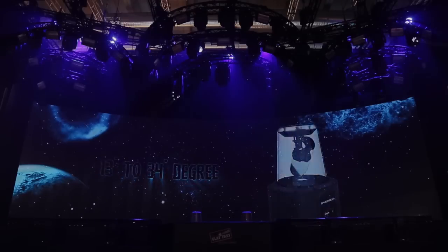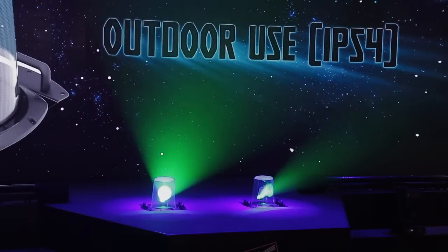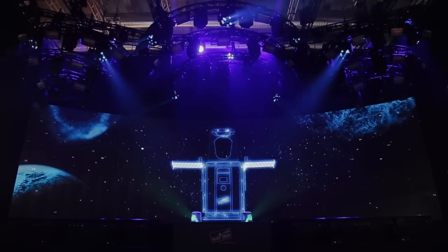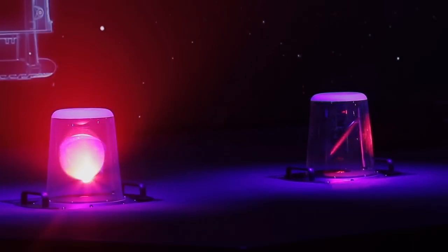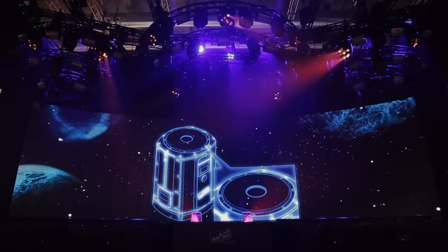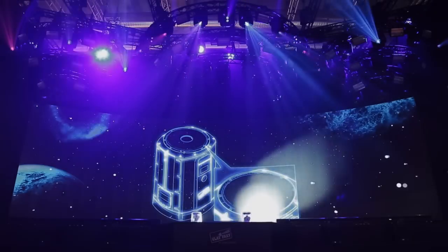Here's another absolutely unique feature — the SpheraScan is also built to be used outdoors. A special housing and the transparent globe which protects its mirror gives it an IP54 protection rating. But that is not all. Just as you can see in this demo, the SpheraScan can be recessed into the stage floor with only its transparent head visible, becoming an innovative part of the set design and making original grazing projections possible. Its transparent globe can be easily removed and replaced with a special mirror holder, making the light even brighter. And, if you like, you can use the SpheraScan to project a gobo directly without the mirror — in this case it may be protected from the weather by fitting a special protection to the front lens with IP54 rating.